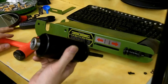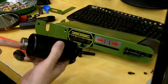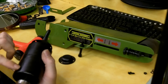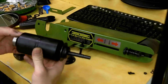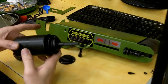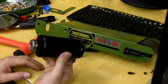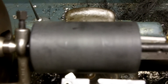That will allow me to put my center on this end as well as the other end and turn it with the dog in the lathe to true up this wheel. I'm not going to show that operation because it's essentially exactly what we've seen before, so I'm going to turn this real quick and then get back to see what's going on.